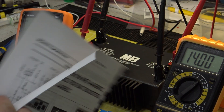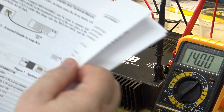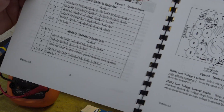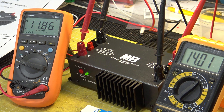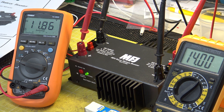It's quite a complex circuit diagram, and I can understand why it's an expensive product — it isn't just a regulated chip. The printed circuit board layout, adjustments, and connections are all available to download from MFJ's website. So that is going to give us the full rail voltage of 13.8V — certainly on a half-amp load, that's what we're getting out of it. And that means our tests will be as we expect them to be, with the radio working at the full 4 watts output. That's what the MFJ 4416C is about, along with the MFJ 4416RC remote control.